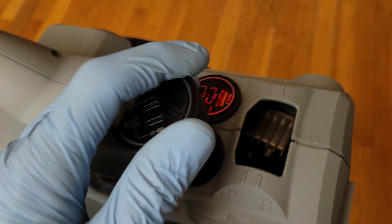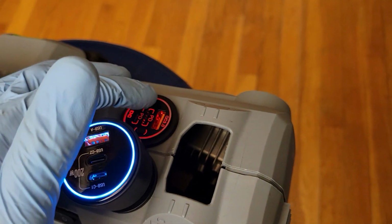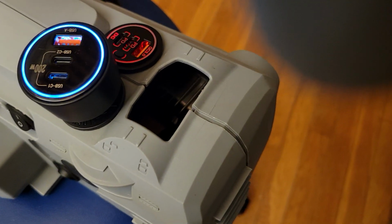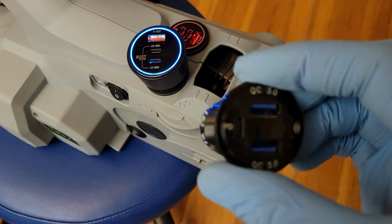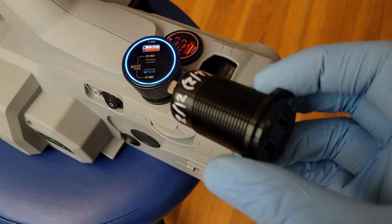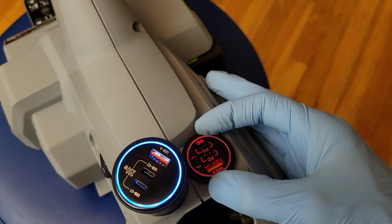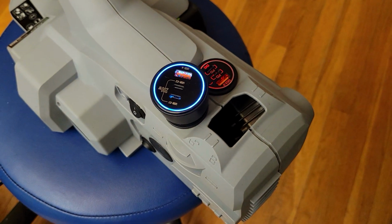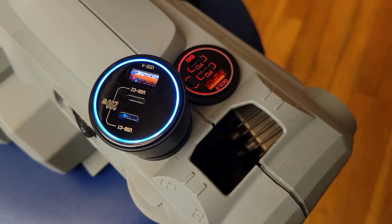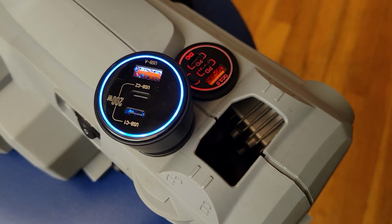And of course the 24 volt converter that can take a 60 volt input is inside there. And if you guys are interested in this one too, this is pretty cool. This little PD30x2. It's a nice doodad. It looks like this on the other side. It just comes with a threaded body and a circular washer that you can screw in nice and tight. And it takes that 12 volt to 24 volt input, and it can take up to 30 volts, which is good if you have like a 24 volt lithium iron phosphate, because those things can get up to 29.2 volts when they're fully charged. So these adapters can take that if you hook them in directly.